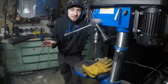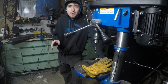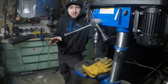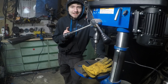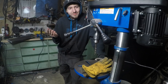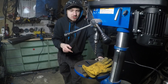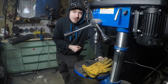I now have all the parts deburred — all the edges that were cut and stuff like that. I've also done a bunch of layout work, laying out and center punching all the holes that need to be drilled. There are eight holes in total. The only issue is that it is all one-inch thick plate and it all needs to be one-inch diameter holes. I was given a bunch of really nice drill bits that I just resharpened, and I'm planning on using those to try and step it up all the way to one inch — so let's see how this goes!